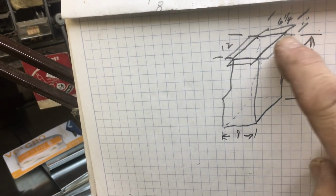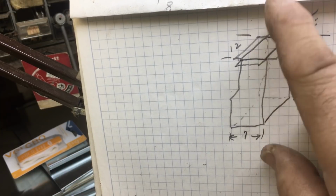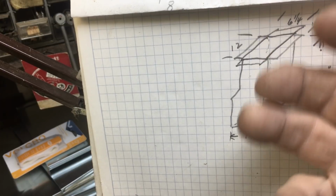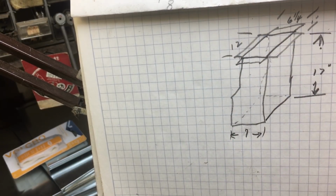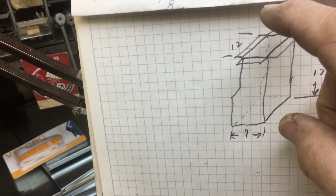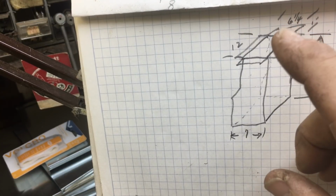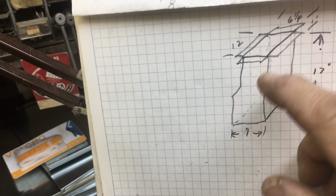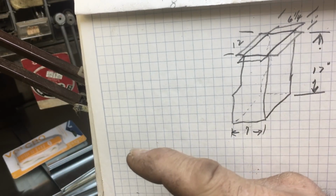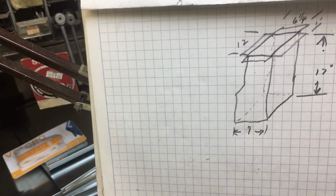But essentially what we're going to do is cut that torpedo boot off just a little bit below the floor joist, allowing his floor registers to stay intact. I'm going to make this just a little bit larger to go all the way around the perimeter of that cut-off torpedo boot, and we'll allow the register dampers up top to limit the amount of air going that direction, so that the box will fill up with air and then take out the opposing side, which will jump the joist space down below, and then with a couple of 45s get into the other joist space to go out to the Four Seasons room.